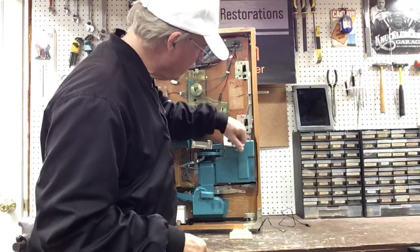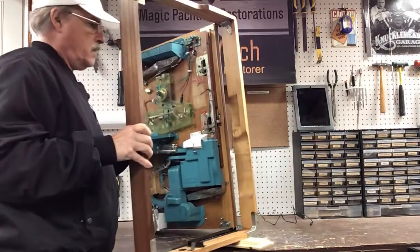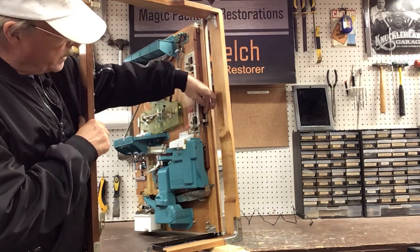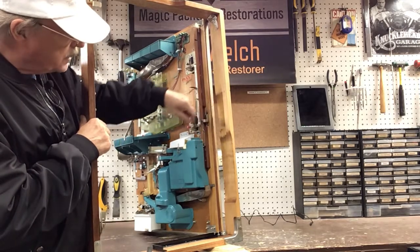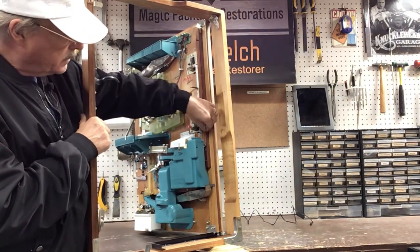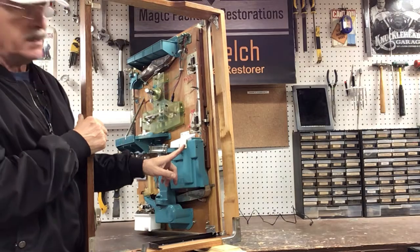Now the mechanism, it's hard to see here. Maybe I can open it up. Okay, I think you can see this. Yeah, this wire right here. So if you put that wire in from the front, it pushes back, which pushes down. And when you push down, it lifts those fingers out of the way. So you want to make sure that this is lifted up here so that the fingers are in place. When the balls come in, they hit the fingers and they stop.